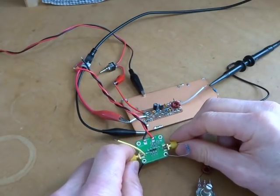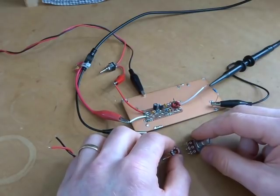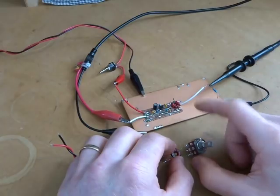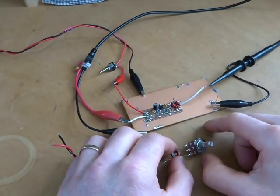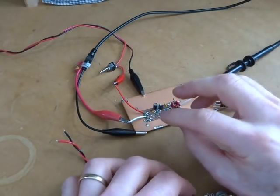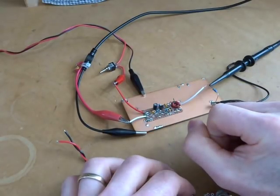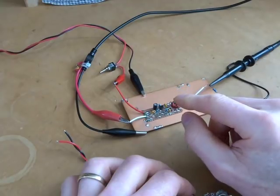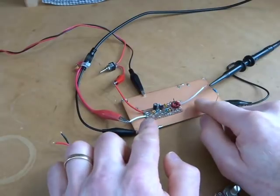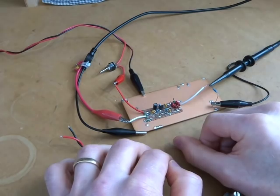The other thing going through my mind is making this amplifier variable rather than having it either off or full-on at 10 dB gain. I was thinking about having a switch on the output between 0, 5, and 10 — say 4 or 6 dB — switching in a pad on either the input or the output to make it variable in fixed levels.